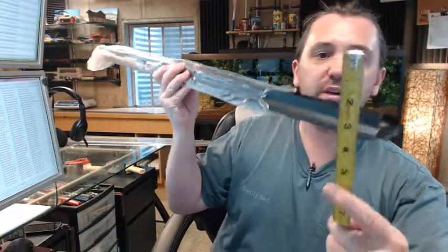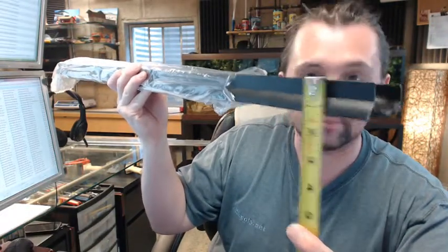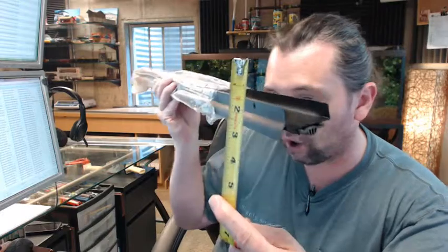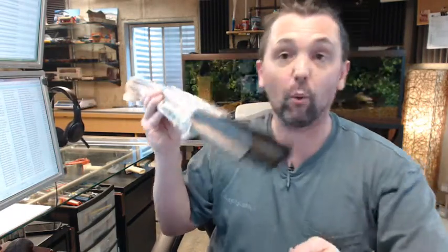Dimensionally, there is an image below this video showing everything important dimensionally about the item. As you can see, it is for inch and three quarter doors. The dimension on the face of the item is 7/8 of an inch. The dimension from the front dimension angle to the bottom of the unit itself is one inch. Overall with the drip cap, a less critical dimension, but about an inch and three sixteenths. What is a very important dimension is the dimension from the bottom of the unit to the bottom of the seal, and that is half inch — measured from inside of here — half inch.